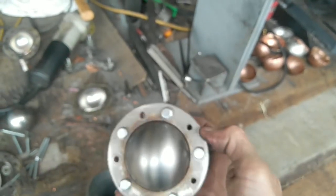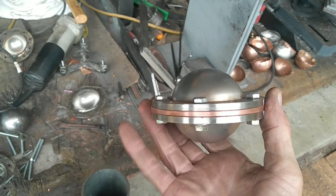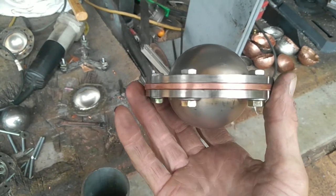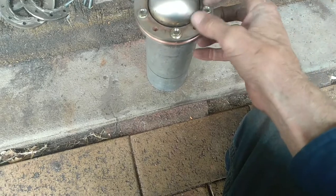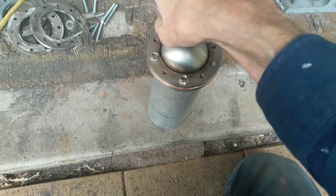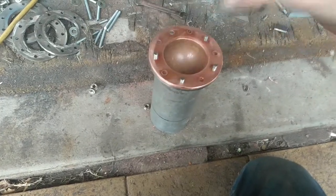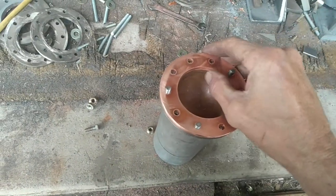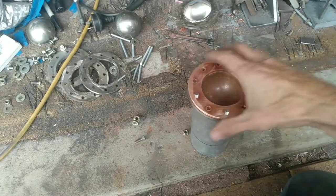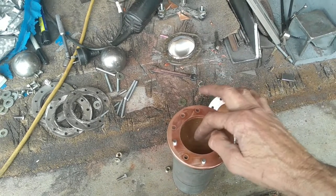It'll create a ring — same as the stainless steel ring on the outside — on the inside. It's exactly 60mm, so it's smaller than the chamber itself. I'll pull that apart and give you a look inside. So there you go — it's got the copper lining now, and that copper holds the other copper rings in and will create a plasma around this edge with the electrode.